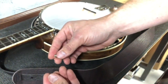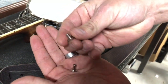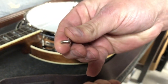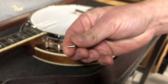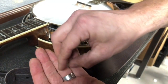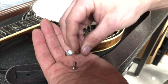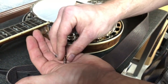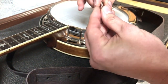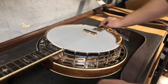One more recommendation: on the threads of the Chicago screw, put a little bit of Loctite if you have it. If you don't have Loctite, just paint a little fingernail polish on the threads right before you put it together. When that dries it'll keep it from vibrating loose, and you can still take it apart later with that nice slot for a flathead screwdriver.